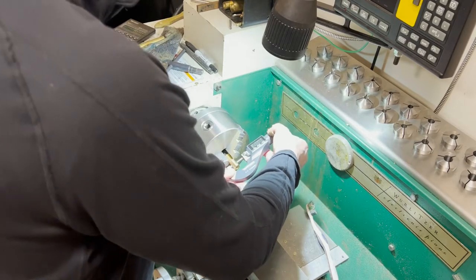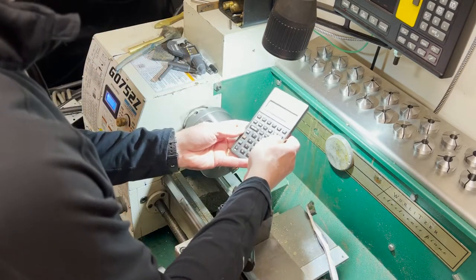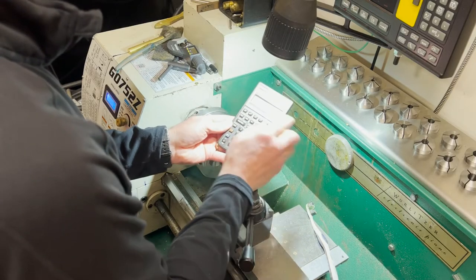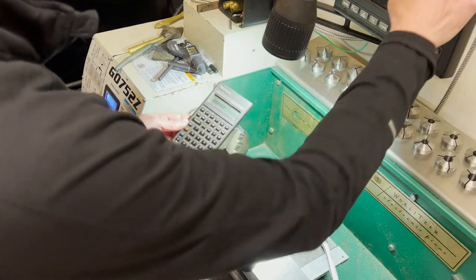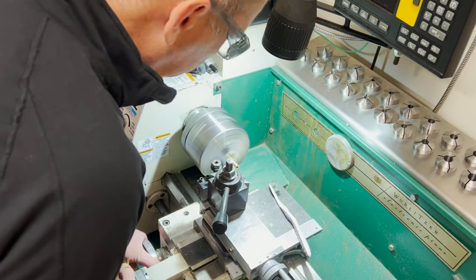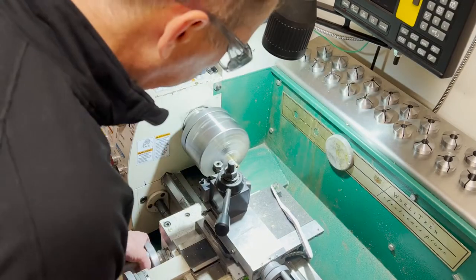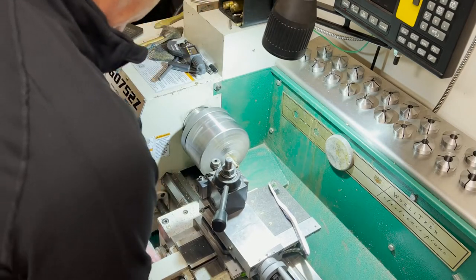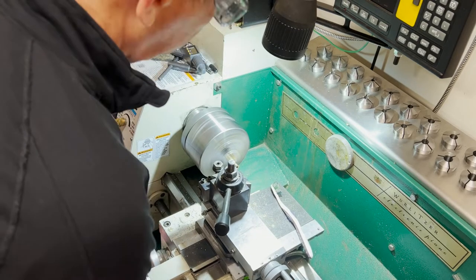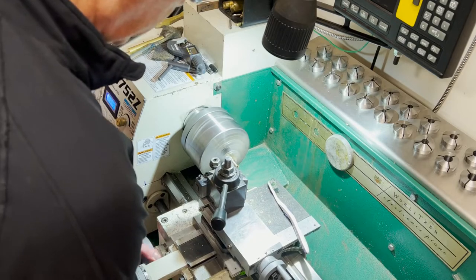I use this mic to check the diameter of that pin and see exactly how much I have to come off. It makes it a very simple process — once I get that number I put it in the DRO and just trim it down. I take light cuts again; this is sped up but I haven't had any problem with the silver solder, though I still go at it very carefully.